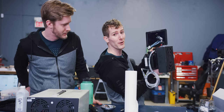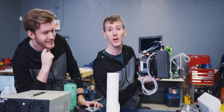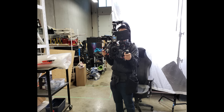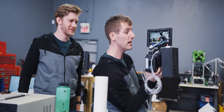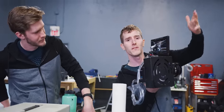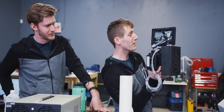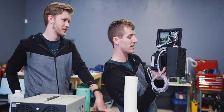So this is it then — it's time to power on this camera and find out if we made it better or worse. You might immediately point at the giant cooling box hanging off it and say it's definitely worse, but I would direct your attention to this photograph of our camera operator. Would another box hanging off him really make a difference? Probably not. So we are getting a fan drive error, but that's okay — we knew that was happening. Whether it's the Noctuas up here, the pump, or the fan, they might not be hitting the RPM that RED is expecting.